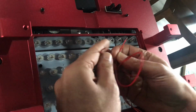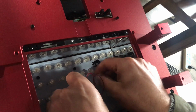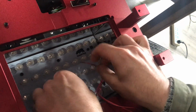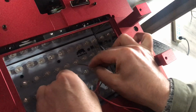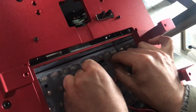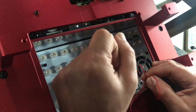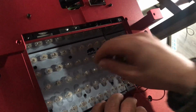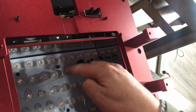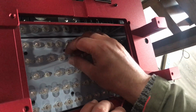All right, I think I need to swap the wires. One more. All right, you can see, you just do the test in the batch or in that group which don't turn on. So finally you have to find whether only one lamp doesn't function and you need to change it. Again, I didn't bring the proper tools, but you can use a tweezer, or you can gently try to remove the lens first, in case you need to remove the bulb of only one LED lamp. It's easy to put it back.